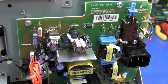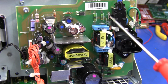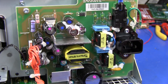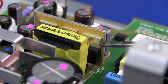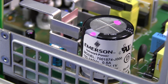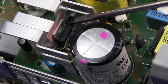We've got mains class capacitors there. About the only thing I don't really like is the soldered-in M205 fuse in there. Why couldn't they have just put a socket in there so if it does blow you can just replace it? And if you notice these three TO220 packages on the same heatsink, they don't actually use any mounting hardware — no screws or anything like that. They're actually stuck on with just an adhesive thermal tape. That's reasonably common as opposed to this traditional TO220 device down here, which is actually strapped onto its heatsink with one of those metal bracket straps.